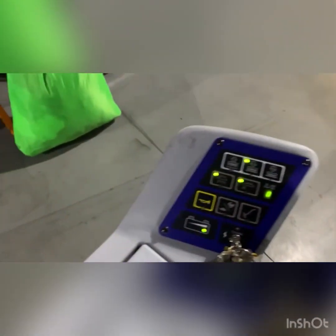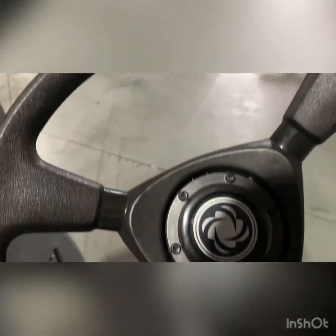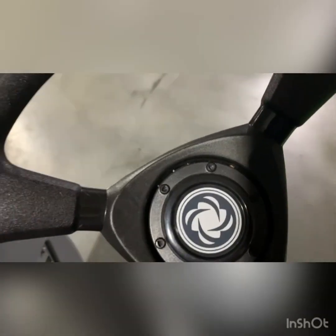There are aggressive types of cleaning, but you want to scrub without using a squeegee in those cases. I'm picking up some debris here — I did dust mop so I may be leaving some streaks. The blades are another wear item; you should keep a spare set of squeegee blades and skirt blades. The squeegee is spring loaded.